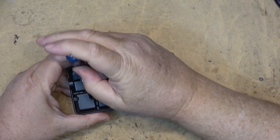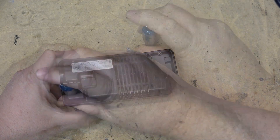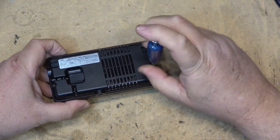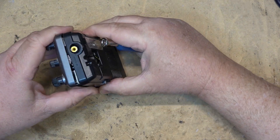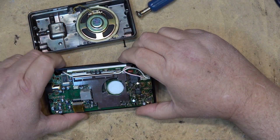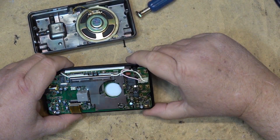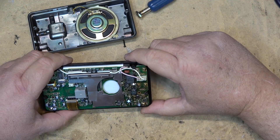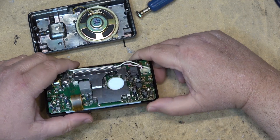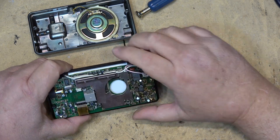To get access we remove the screws from the back. I've since replaced this radio so it's not one I'll really be using - I just like it to work. I replaced it with a nice new Yaesu Fusion receiver. Here are the caps I changed last time. I didn't change some of these other ones because I didn't have enough of them, but I'm going to check them out. I think the ones I put in are probably okay, but some of these other ones here may be the culprit. We'll check the ESR.